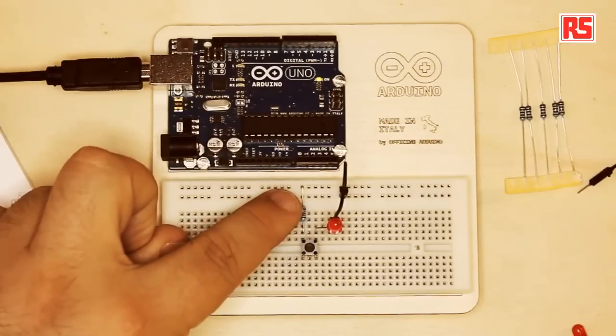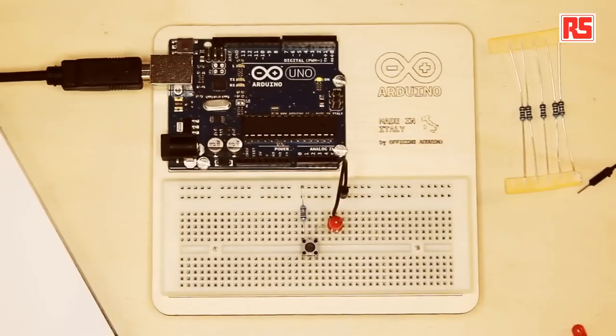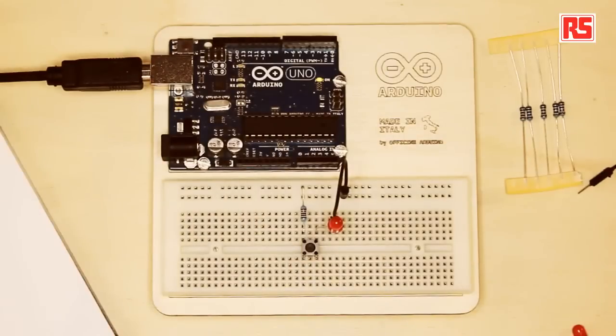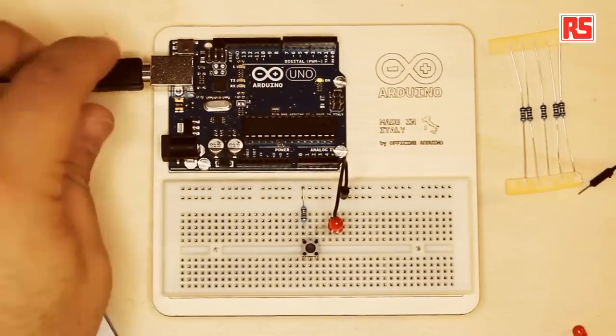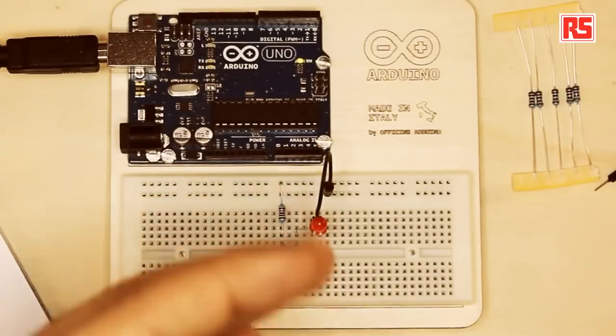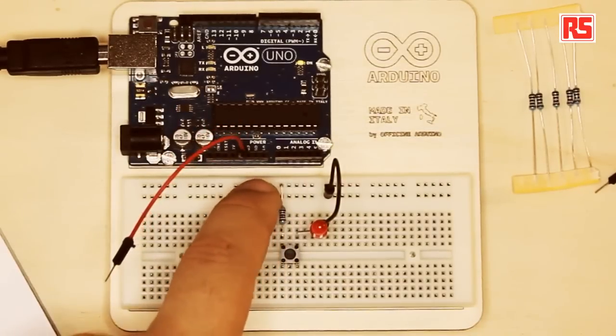I've prepared here a circuit that contains all the basic elements: this is the resistor, this is the push button, this is the LED, and this is a wire. What's missing is the source of power. What a circuit needs in order to operate is a source of electricity. We're going to use the Arduino board as a source of electricity — it can be powered through a battery or through a USB connection. We're not going to use the intelligence of the Arduino board, just the power from it, to learn how to build the circuit on the breadboard. So we're going to connect this wire to the other leg of the resistor.